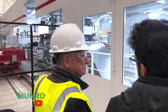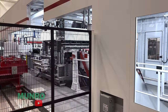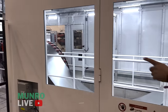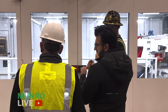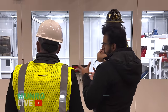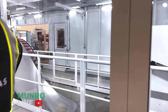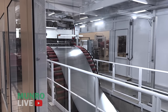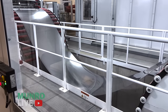This is the first of its kind laser blanking line. It takes coils, unwinds them, and takes out the internal stresses from the raw material by passing them through a leveler — a set of work rolls moving up and down to flatten the part. We have to be careful not to work the material too much, which causes work hardening. This leveler is something primarily used in mills, so we actually sourced it specifically for a blanking line.